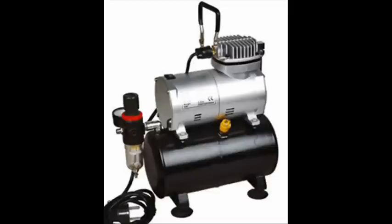A quick talk about my compressor. As we know, the past couple of months it has been having issues with its pressure switch, cutting out, overheating, and I'm also finding that it's overdrawing the electrical circuit that it's on. I have a radio attached to it, as you may sometimes hear in the video, and occasionally when it starts drawing really hard and spluttering, the audio cuts out, the lights dim, so this is starting to become electrically unsafe.